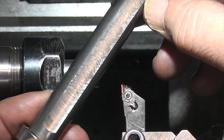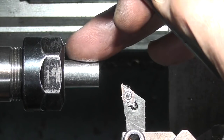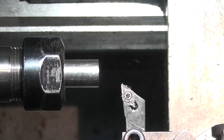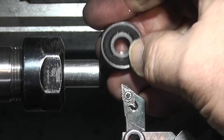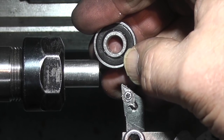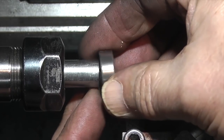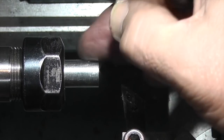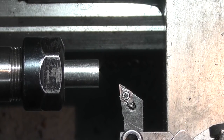I think it's about 16mm diameter and the chuck only goes up to 13mm. So I've found a smaller diameter piece of steel and I just want to turn the end down to fit the bearing. The bearing I'm going to use has an 8mm bore and a 22mm OD. So I only want to turn the last little bit down so I can press this on there, and then I want to test it to see how accurate it is on the machine. First thing I'll face the bar off and turn the diameter down to 8mm by about 10mm.